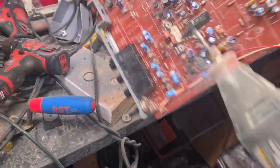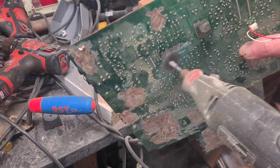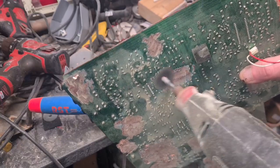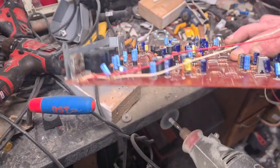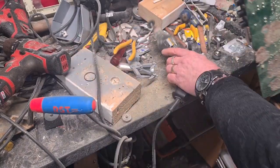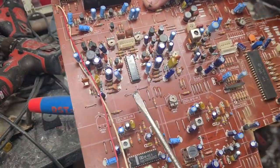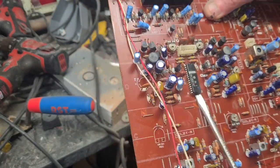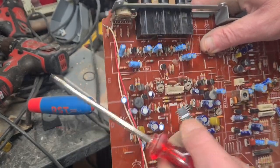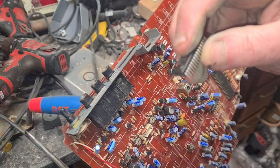Let's try this IC circuit here. So we've got all the back of the IC, or the solder off, and get our screwdriver and we should be able to just lift that up. As you can see — comes straight off. No damage to the IC. A couple of legs need bending back into place but that's about it. That IC took me seconds to get off.